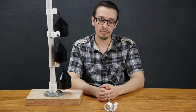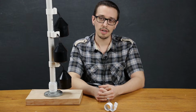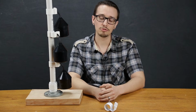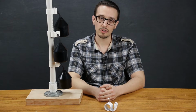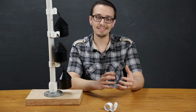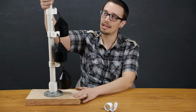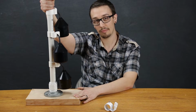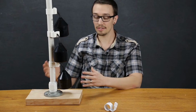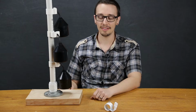They do also offer some great mounting brackets, which we'll discuss in some future videos, and we'll try to put a link in the comments or in the description of this video as well, so that you can familiarize yourself if you're interested. It's a nice little bracket that mounts inside of the basin or riser, and then it attaches to a T at the top of your float assembly, and it just snaps into place. So that's really an excellent way to troubleshoot and work on the system. It's really convenient for the guy who comes back after you do the installation.